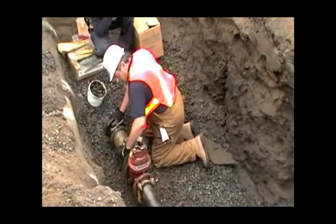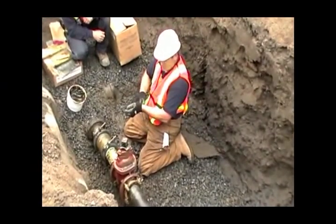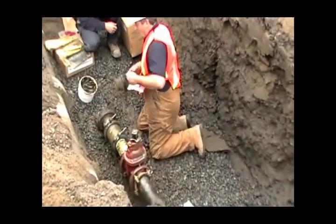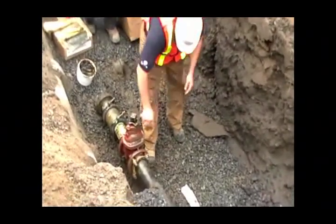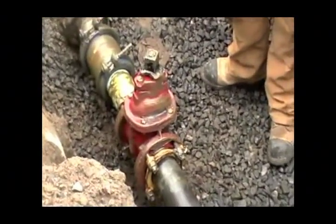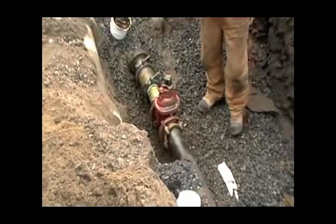Okay, folks, that's about as much as you have to paste with it. There's just a thin film of this everywhere, and that really is the corrosion inhibitor. What I'm going to show you next is a couple of profiling materials, and they're basically designed to fill voids and cavities, especially around these nuts and bolts, so that you have a smooth area for the tape to not fall on and basically push it away. You've actually got some support right around the nuts and bolts.